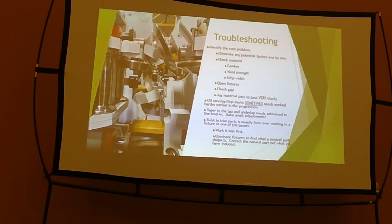If you have trouble and something used to work, I would be willing to bet that there is an alignment issue that has showed up because something is worn out or something's changed or somebody made a bad adjustment on a roll tooling, or the Leadin got smacked by a forklift, or your uncoiler got hit by the forklift or whatever. There's so many times that things were designed to be in alignment and you don't have to look at that. You don't worry about it. The machine's built that way and it works. But then all of a sudden that thing gets out of alignment that it was set up with originally. And it's a head scratcher. Why did this change? It's probably alignment.